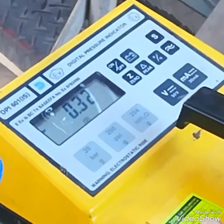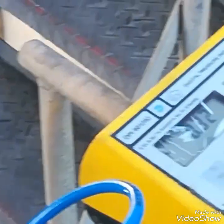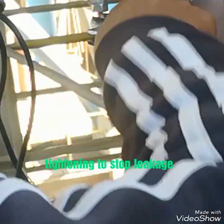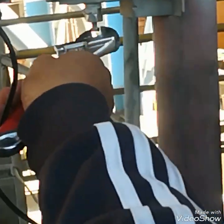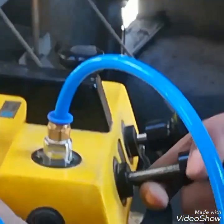Now I will give the pressure — this pump is 100 bar. You can see that now I am tightening the dead plug to prevent any leakage. It is very important to stop all the leakage so our calibration results will be better.